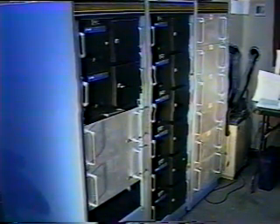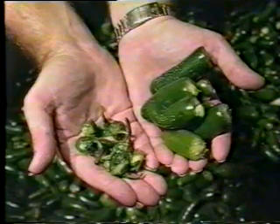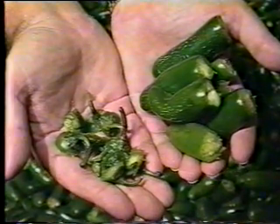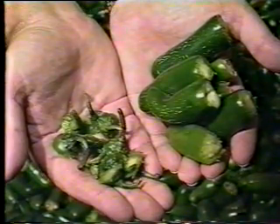All of the machine functions are monitored or controlled by the computers in the control room. The peppers may even be monitored visually as they pass under each camera, and the computer places a cut line or a reject target line on each nest being processed. The system computers are 486 IBM-compatible systems operating at 25 MHz, all equipped with custom-built high-speed asynchronous frame grabbers capable of processing one-half a megabyte of information every 55 milliseconds.